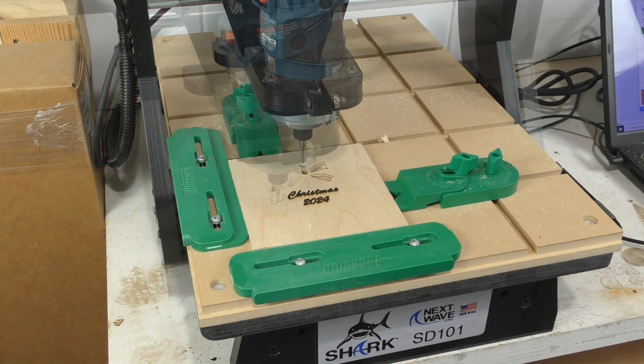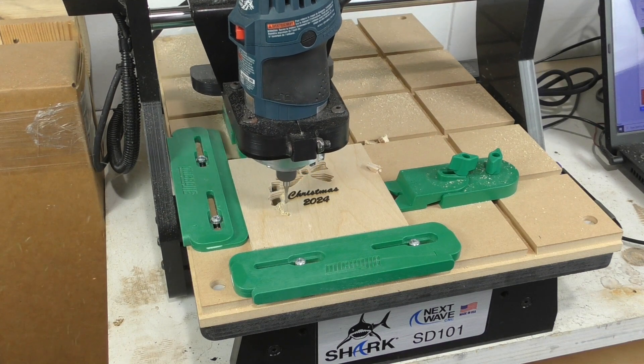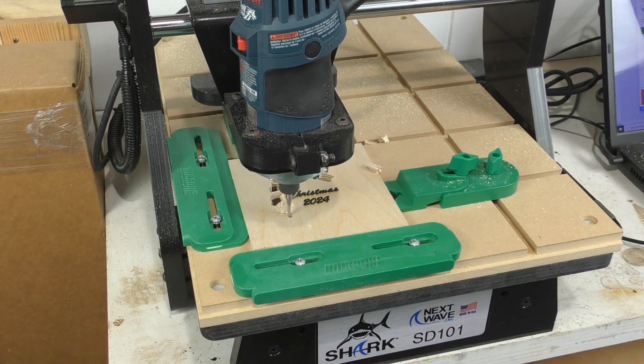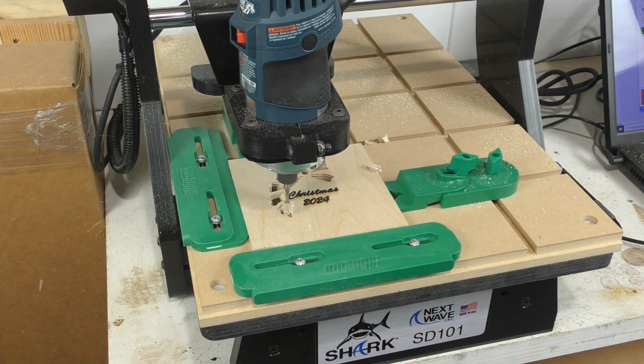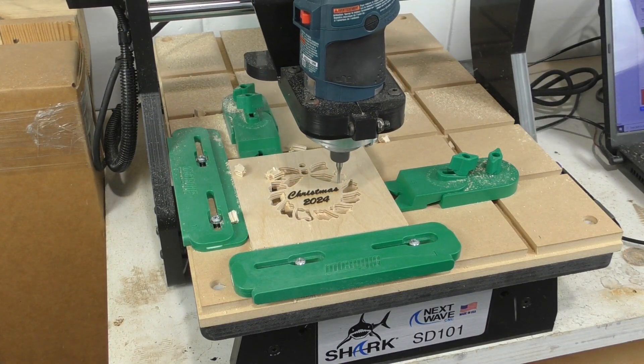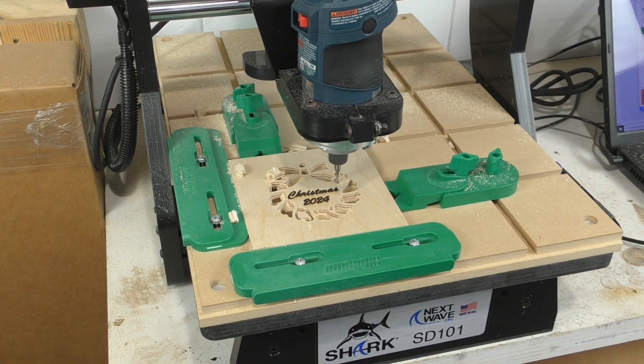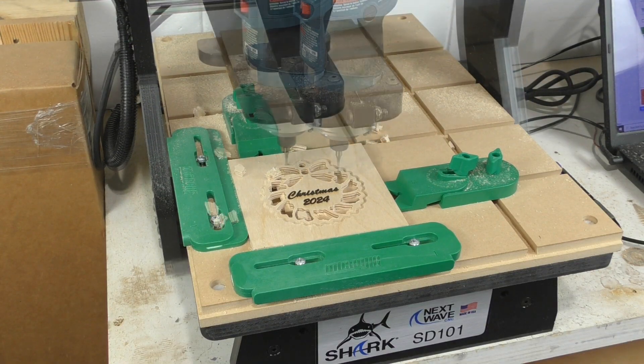The details of the wreath are being pierced through the 1/4-inch Baltic birch plywood that I'm using. You'll notice that I'm not tabbing any of the small pieces that are being cut out. They're small enough not to be physically dangerous, and there's little enough chance of them interfering with anything, so doing this means I don't have to cut a bunch of tabs and then sand them smooth.